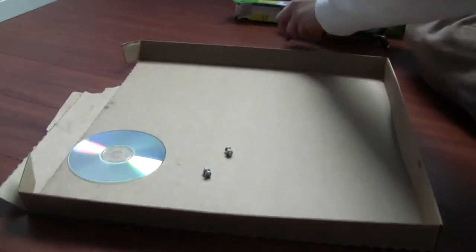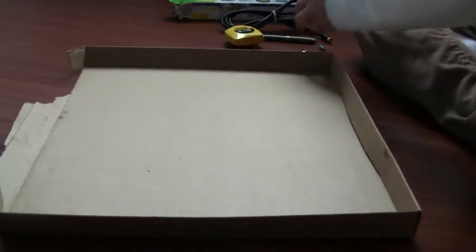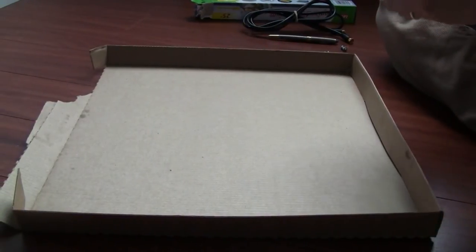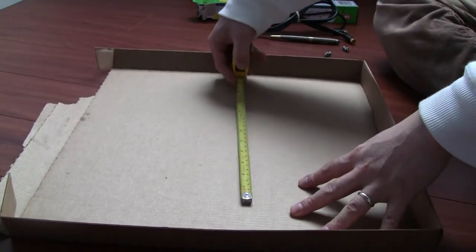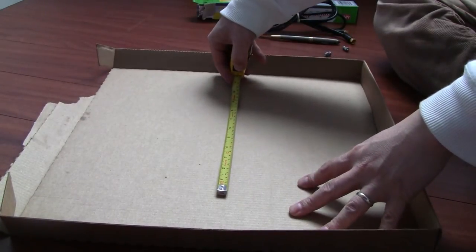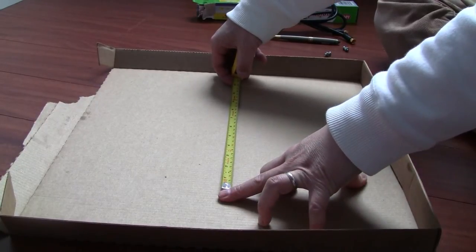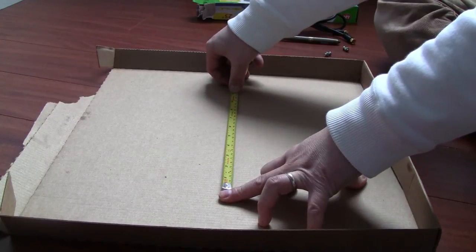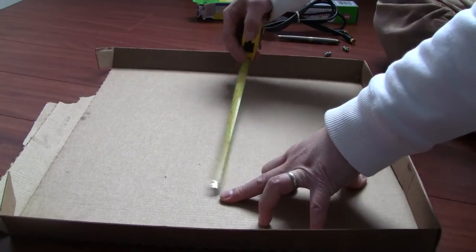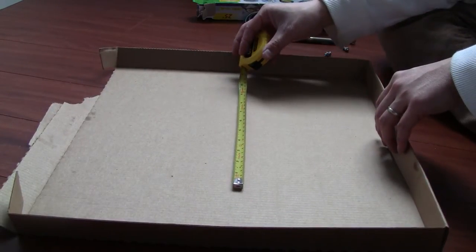First, a cardboard. The cardboard has to be exactly 8 inches in diameter. So it has to be this big, 8 inches. For this antenna, it's not like the bigger the better. So it has to be 8 inches. If you go to 10, probably not as good as 8 inches, okay? Because of the frequency of the signal you're gonna receive, 8 inches diameter is the perfect size.